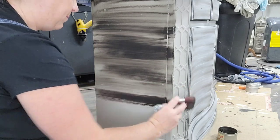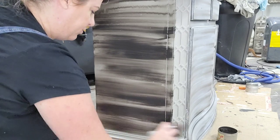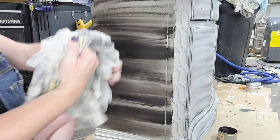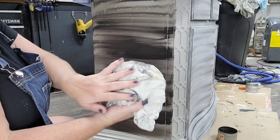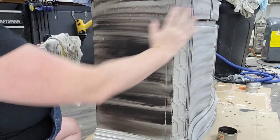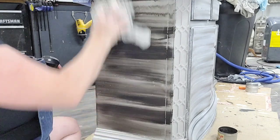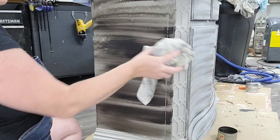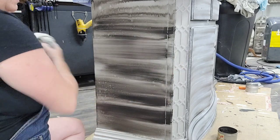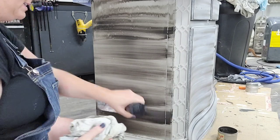I'm going to wipe this paint back off, so I make sure to add a whole bunch of water and keep an extra streaky coat. Once I've got it fairly evenly covered and nice and wet, I take a rag — in this case just a t-shirt — and bunch it up. I like when it has wrinkles on the front because those keep some interest in my wipe marks. All along this piece my wipe marks are in a horizontal motion, so I want to stay horizontal as I wipe the sides. My first inclination is to wipe vertically, but I want to keep these marks consistent, so I plant the rag and pull it back.